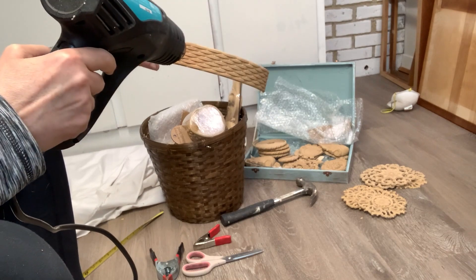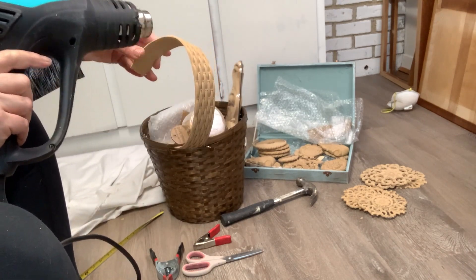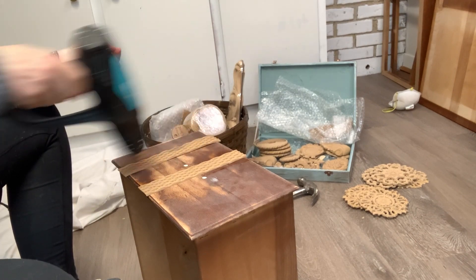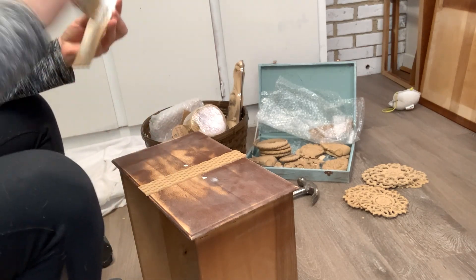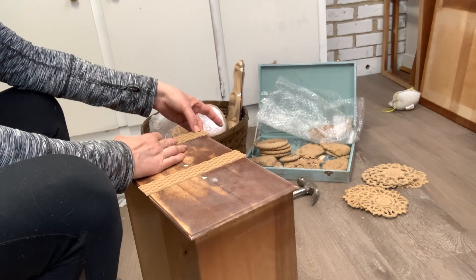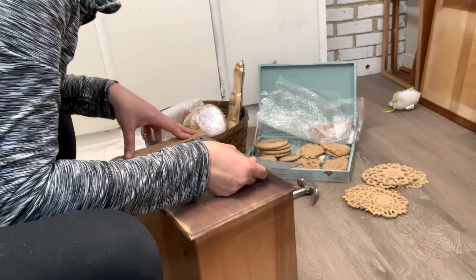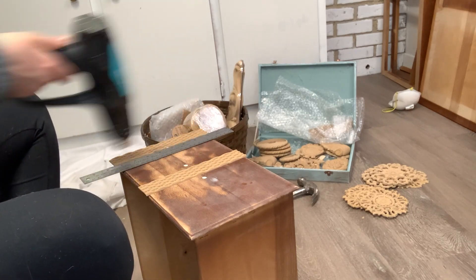I added some wood-you-bend basket weave trim onto the top drawers, and this gave them real texture and interest — it turned out fabulous. I spaced it so it's not side by side; I left spaces in between using a ruler and eyeballed it to make sure it was straight. You just heat this trim up with a blow dryer or heat gun, and once it's warm it's very pliable and easy to cut. Then using wood glue, you place it where you want and glue it down. It's sandable, drillable, stainable, and paintable. I have a full video on how to apply wood-you-bend to painted furniture — I'll include that in the cards above and in the description below.